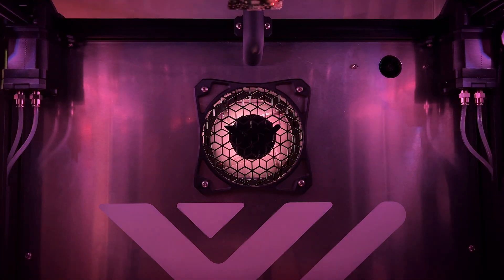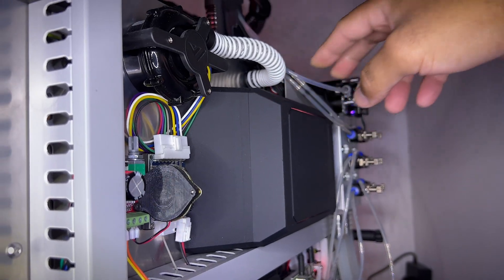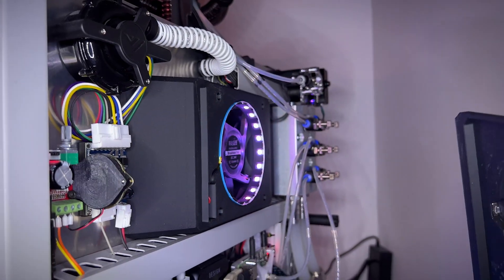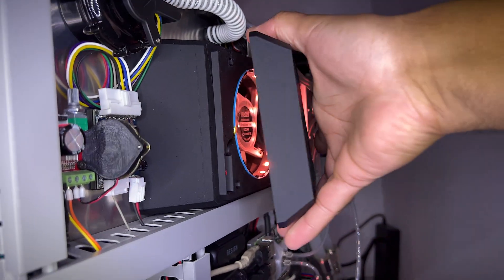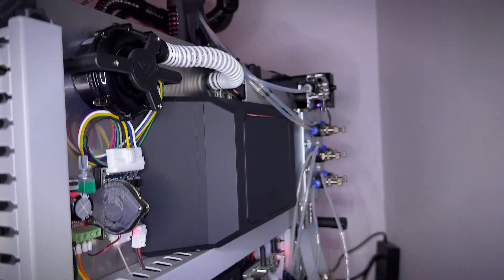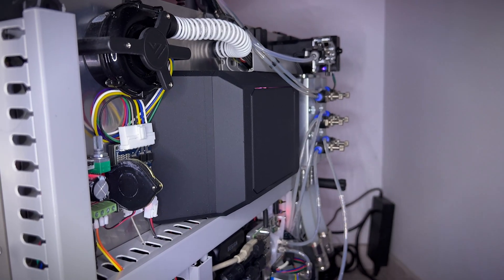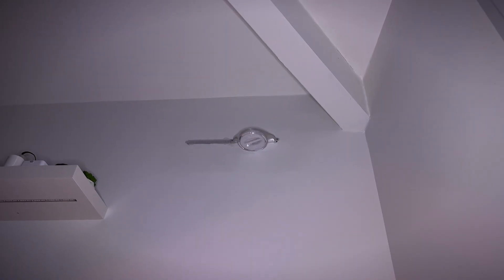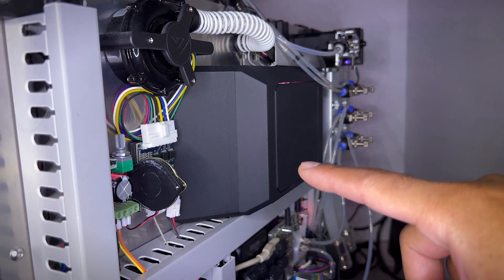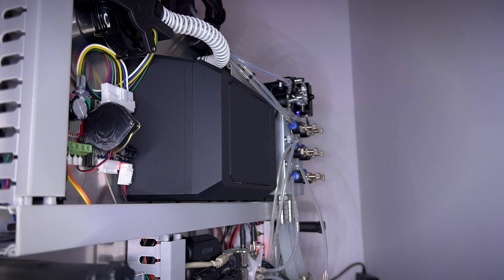Another light is part of my most recent modification, which is the magnetic flap vent for the exhaust fan. It's magnetic because I can take it off easily. This is the LED strip we saw from inside the printer, and there will be another magnetic adapter. When I print ASA or ABS I want to get all the fumes outside through the extraction hole, and this one will only be used when I print PLA or PETG.